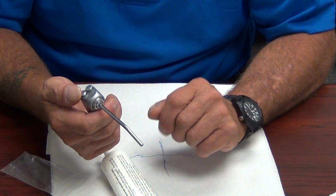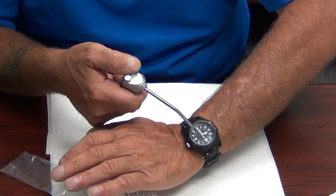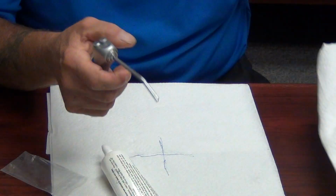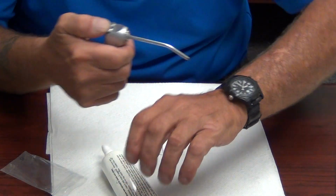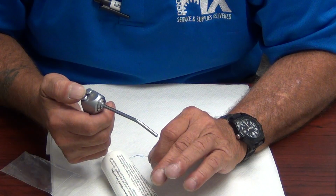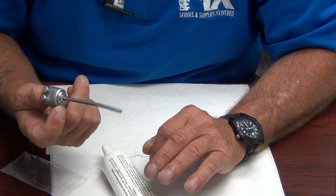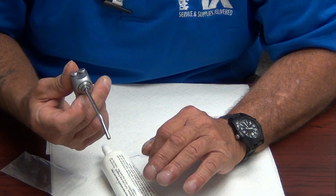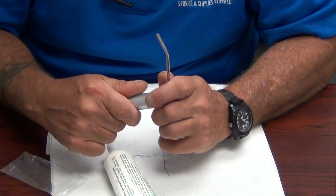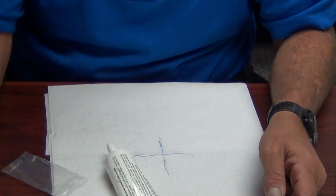One more test, excuse me, on your watch crystal, squirt water. Dry the water off. Then hit air only. You should only get air when you push the air button after your rebuild. That's going to be one of your main problems, is air in the water. It's all due to the O-rings and the tip holder and replacement of the tip holder. As usual, guys, if you have any questions regarding this syringe or any further questions, you can call Paul or myself.